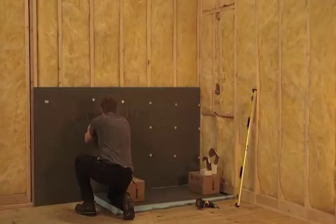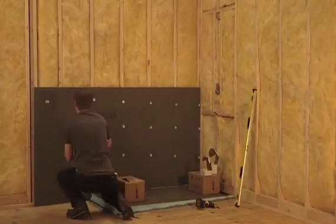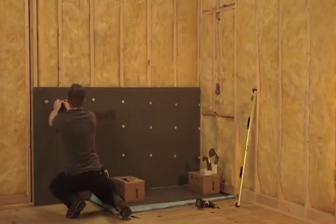This first row of washers and screws will lock the building panel into the sealant under compression. All other tab washers are now installed 1 per every 12 inches on every stud. In the upper area, fasteners are installed right into the transition seam to the next WEDI building panel, creating a flush transition between 2 panels.